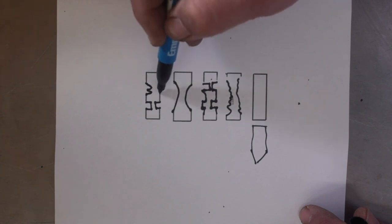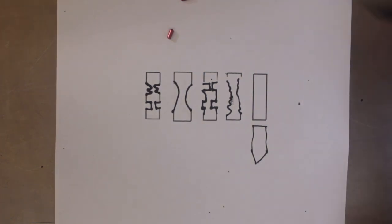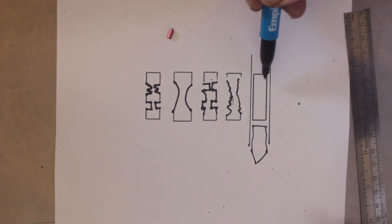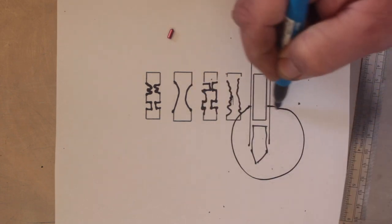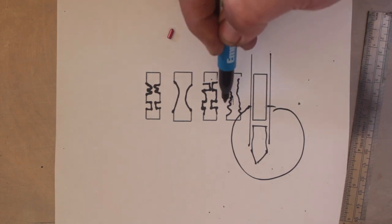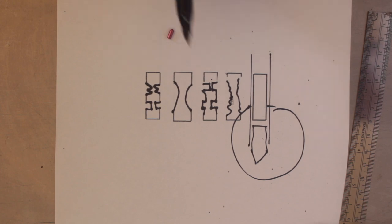Any configuration can work, but one thing you've got to be careful of is these pins have to slide up and down inside the chamber. The outer diameter here needs to be kept as a guide rail for the pin to move up and down. If we notch too much out, what will happen is at your shear line, when you put your key in and apply a little bit of pressure, these fine edges can get caught. So we want to increase the security by giving it a pick-resistant feature, but not mess the lock up to the point where it's hard to get the key in and out.